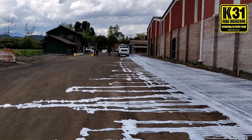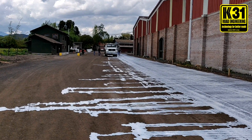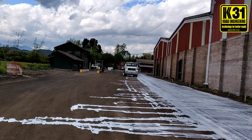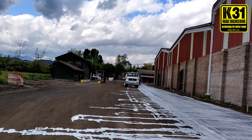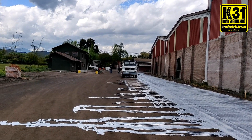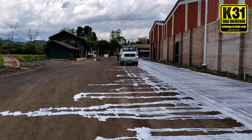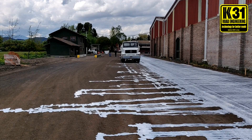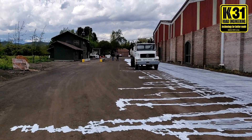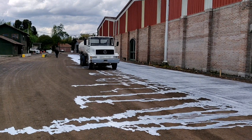This is the next day, or possibly the same day in the afternoon. You want to make sure that between each seal coat the road is fully dry — just touch it with your hand and you'll be able to tell, no scientific equipment needed. If you notice, when the water truck is spraying the APS now, everything is running to the side because you already have one seal coat on there. The road right now basically has a coat of plastic on it.